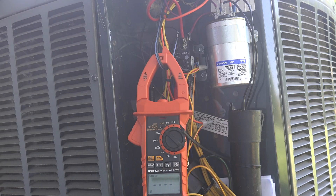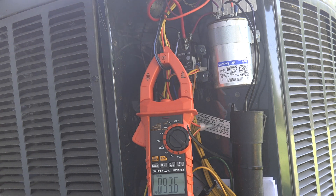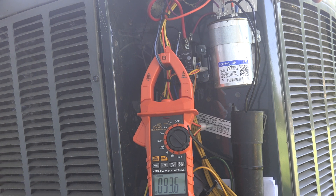You can see I've got the Superboost hooked up now. Let's go ahead and try this and see what happens when we start it. Okay — looks like we're at about 93 amps. Pretty much the same amp draw, and it appears to start at about the same speed.